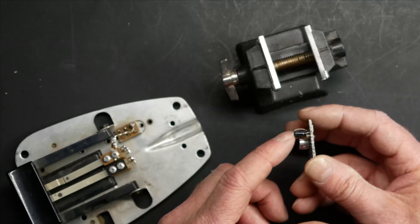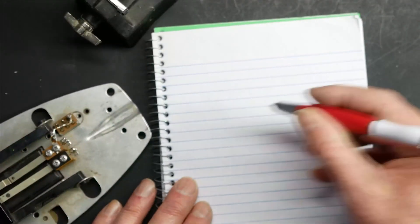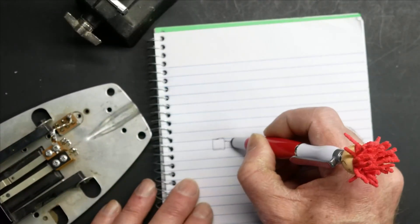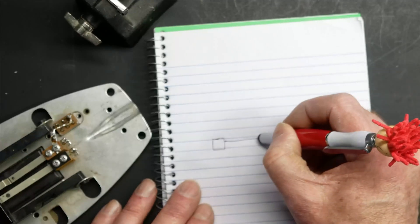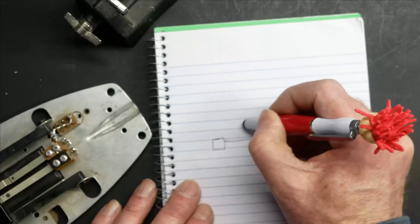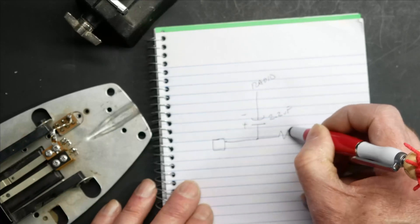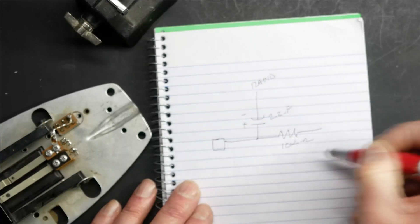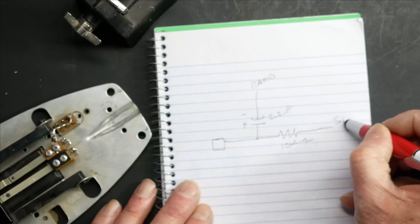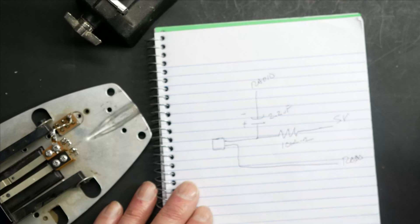This capacitor just prevents DC from getting into the mic circuit, filtering out any DC that might be coming out of the mic element. So the circuit board has our mic cartridge, a positive coming out of the mic cartridge, an electrolytic capacitor going to the radio, and further down our 10K ohm resistor going to 5 volts in the radio. The ground side is even simpler — it just goes to the radio as mic ground.